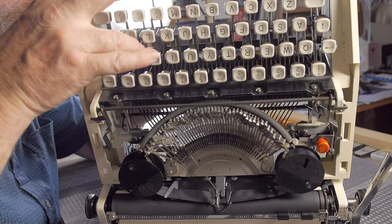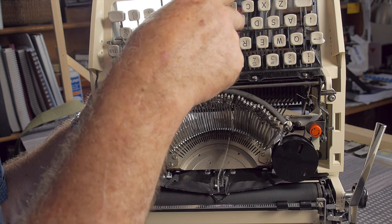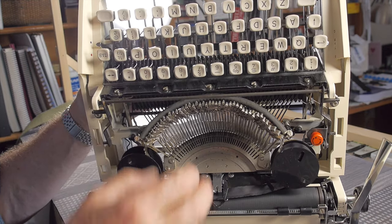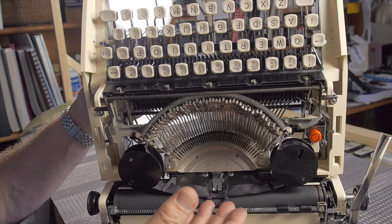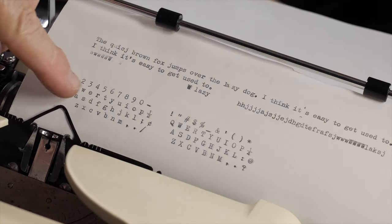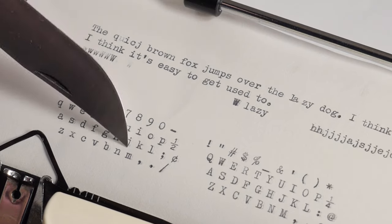Let me activate that bar here. Holding it from returning — you can see the R is a little sluggish, the T is faster, the Y is faster, the E is fine, but the R is just a little slower. The seven is also a little bit sluggish still. So this is a good way to test for intermittent sticking type bars: turn the machine on its back side, pull that ribbon linkage bar back, and the keys have to return under their own spring pressure only.